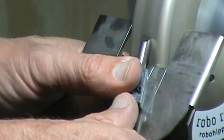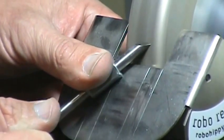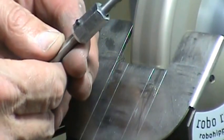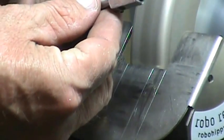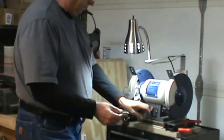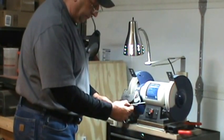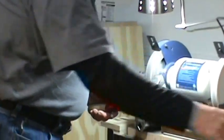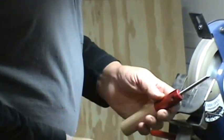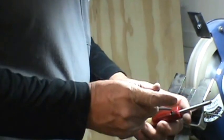You can put a little skew on one end and your point tool on the other. I have a nice little skew. If you put a skew on one end and a point tool on the other end, all you have to do is take the one out of the handle and flip it over. Now I have a point tool on each end of the tool steel. Slide it back into the handle, lock it down, use it until it needs sharpening, take it out, flip it over — fresh edge, ready to go.